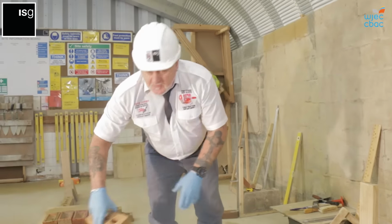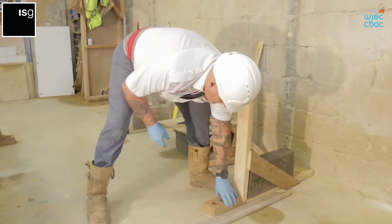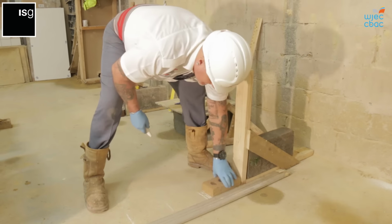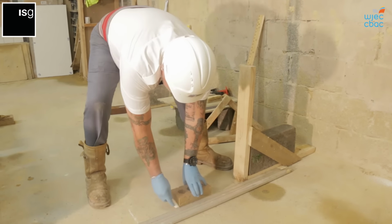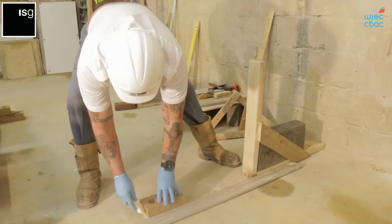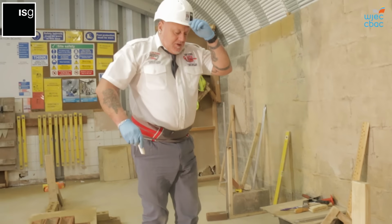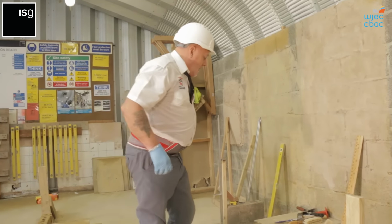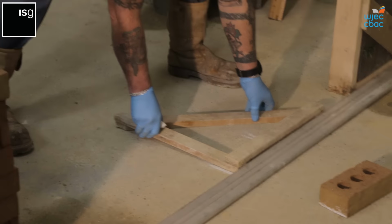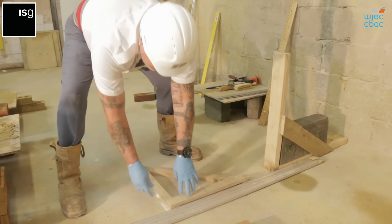Then for this quoin we need three full bricks from the door frame. So we place a brick there, strike a line, allow 10mm for a joint, then put another brick, 10mm for a joint, and then your final brick. We know we need three bricks out because there were three bricks damaged on the quoin on Sunny Cove Lodge. Then we use a square which goes against the straight edge, so you know that's the end of your wall, that's your three full bricks coming out. Strike a line.